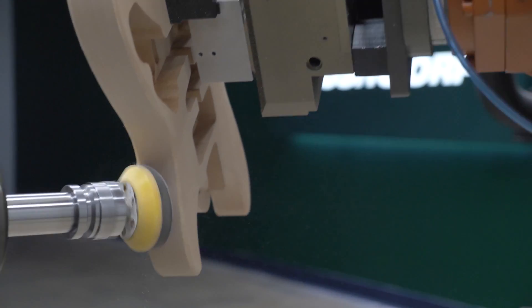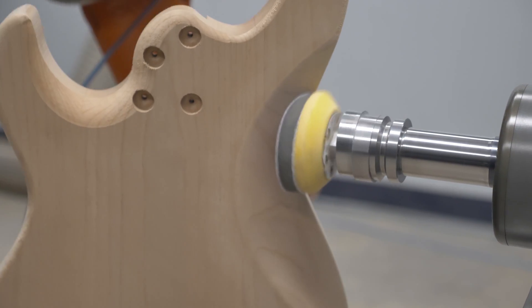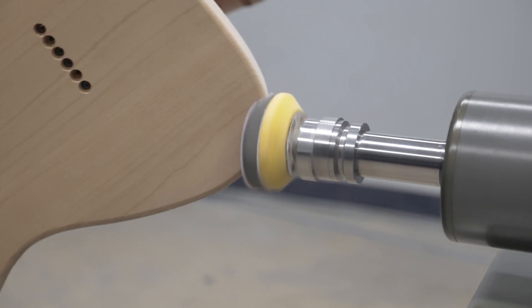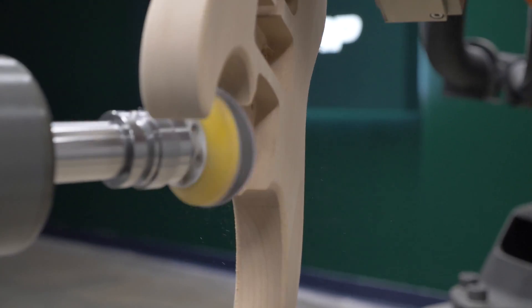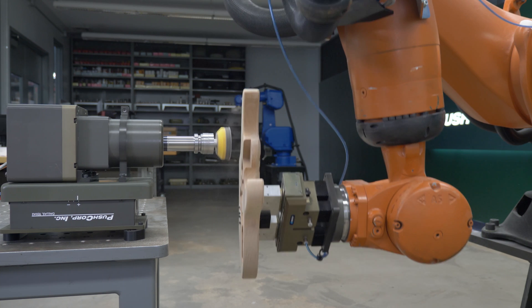Small radii are difficult to sand uniformly. Common issues are sanding in flats or oversizing the radius with an overgrind. Our approach to this small radius corner on each side was to slow down the RPM, lighten our compliance force, then run the interface pad over the radius at multiple angles. Light RPM and force parameters were also used on the contoured areas near the neck. The biggest difficulty here was accessing the whole contour. The end user will likely have to have an operator hand sand where we couldn't reach.